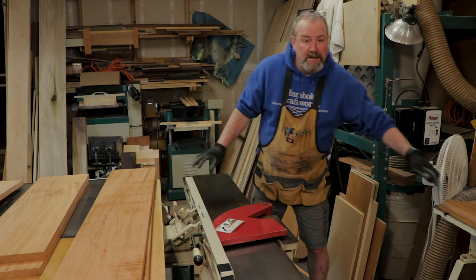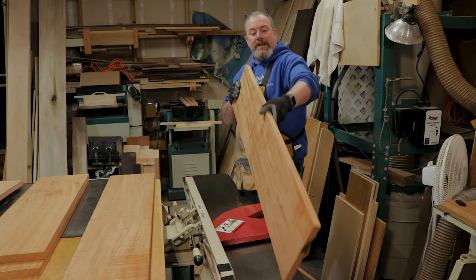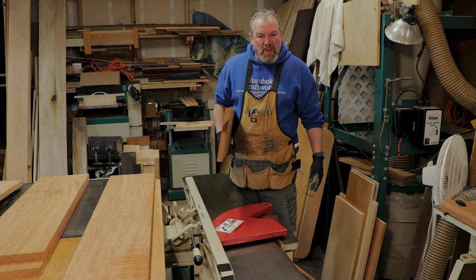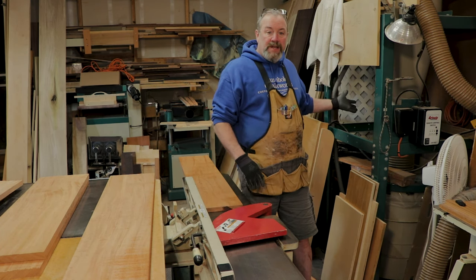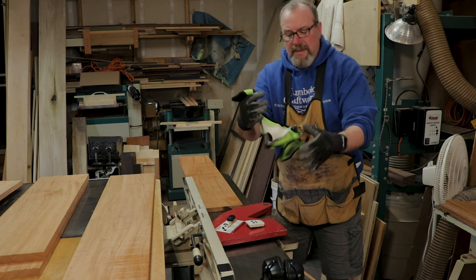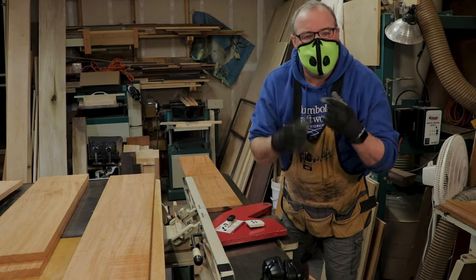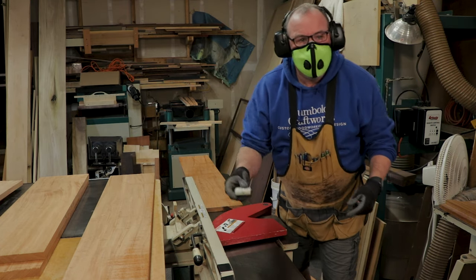I placed all the boards here in the upright position so the crown faces up. There's a slight crown to each one of these things. Very important that you wax your tools — there's a video on waxing your tools. Your fence is square and everything is ready to go. Your dust collector is empty because you're going to fill it up pretty quickly. Make sure you wear your safety equipment — mask, safety glasses, headphones — because it's going to get loud.